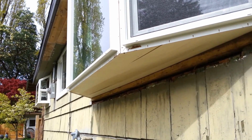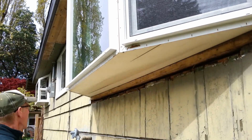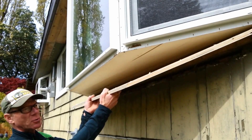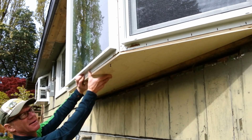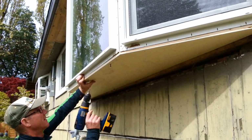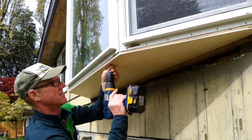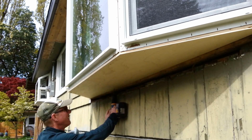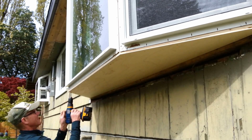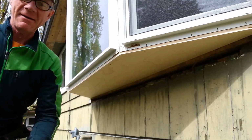Okay, we're rolling again. And now, here's my piece of plywood here. Like I say, we're doubling this bottom up, so this is going to be a full inch and a half up in here. See, and like I say, it's already been pre-drilled. There's one. Now that has not gone into the inside of the plywood on the inside because the screws are just the right length. And so that's what we're going to have, see. She's all doubled up. It'll be real nice.